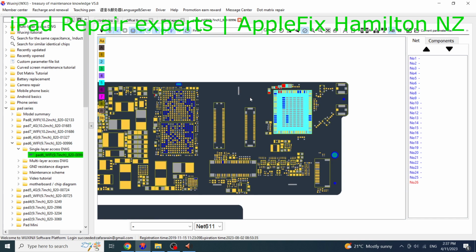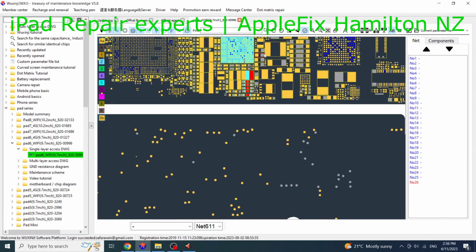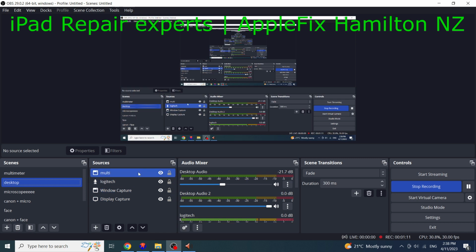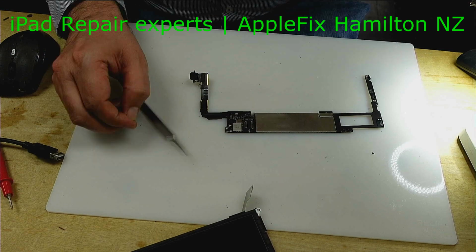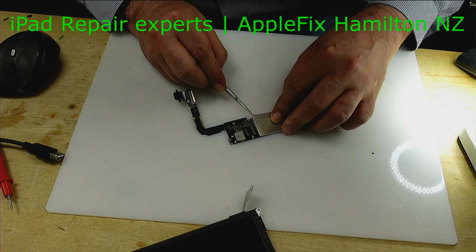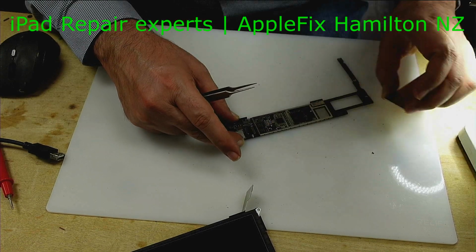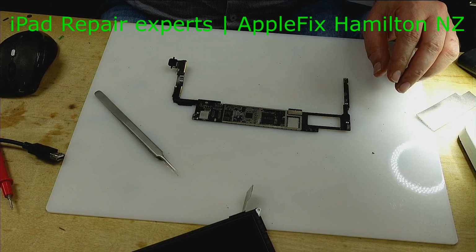Okay, so if this line is shorted, usually we can see a capacitor which looks ugly. Now some of the capacitors on these lines are located under the metal sheet, so we would like to check it before we do anything. So let's check here. Okay, I have to check under the microscope.